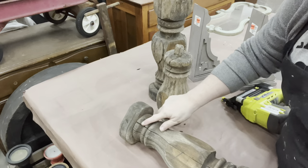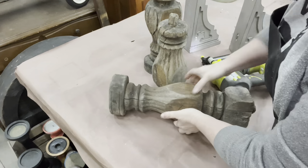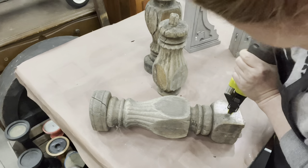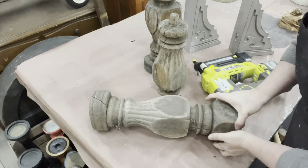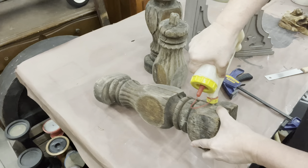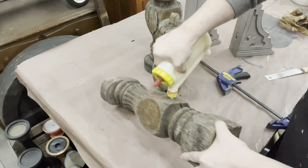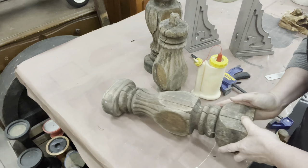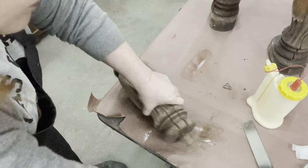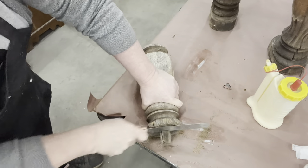What do you think these three pieces came off from? I'm thinking probably some type of a porch. They need a little bit of help — just because they're salvaged finds doesn't mean everybody wants to spend time fixing them into decor. So that's my job. This was three pieces of wood to create one beautiful piece. My brad nails weren't quite long enough, so I'm going to need to glue and clamp these pieces together. Just like the previous pieces, I need to make the areas flat, so the Japanese saw has come in very handy.